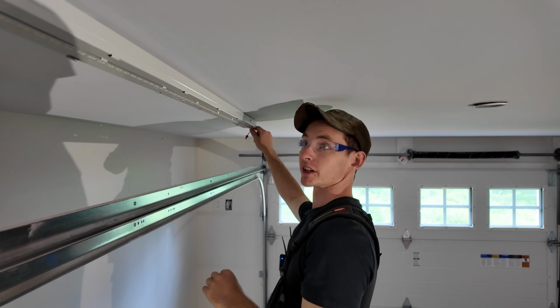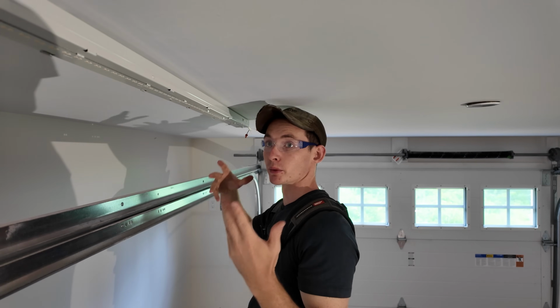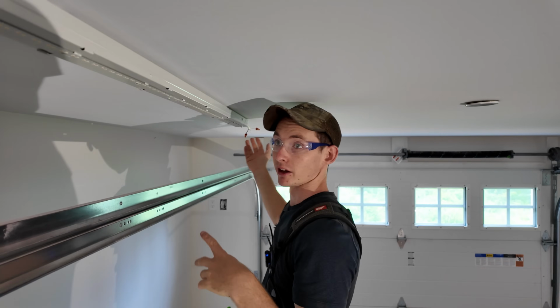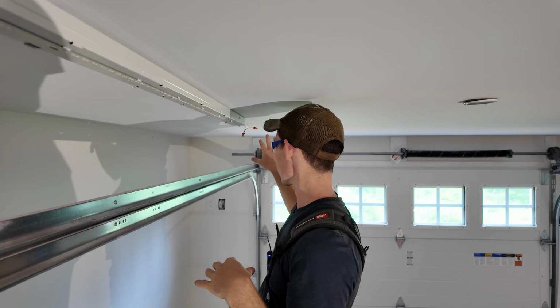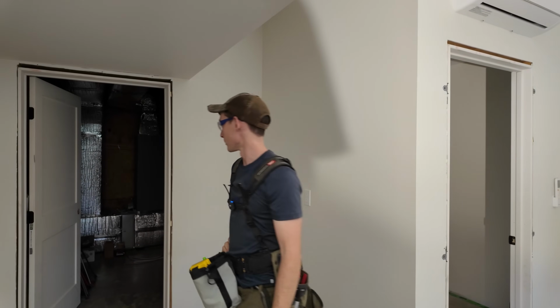All right, capped off the end of this run here with a couple wire nuts. So we should be good to install this bezel, and when we go to test, we can turn this on without anything else going on down here. We can put that light on later. We're gonna go ahead and test this one, just because why not? I'm gonna flip the breaker on.